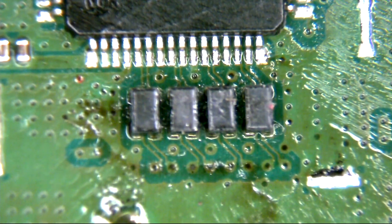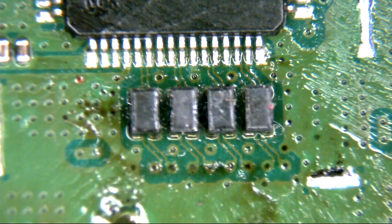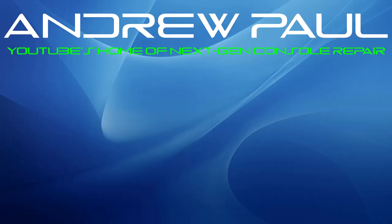Thanks for watching boys and girls. I'm sorry we couldn't go through every step of that replacing all the bits and pieces - a little bit restricted for time today. But hopefully you've learnt something there with measuring the coils, because that can point either to the issue itself if your port's looking good and everything else seems okay, and it can also point towards further damage to your encoder IC up there. Thanks for watching, hope you've learnt something. Please remember to comment, rate, like, and subscribe to the channel if you've found this useful. We've plenty more content on there and there's lots more to come.